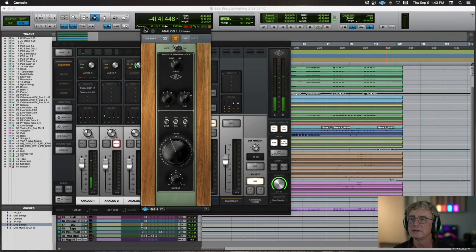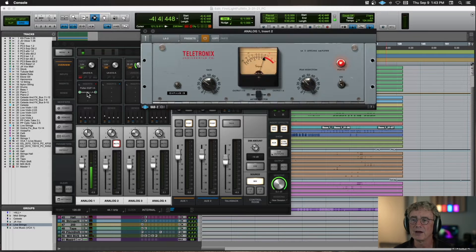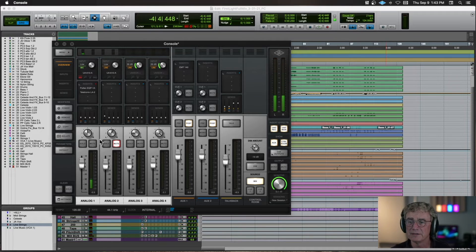The way this all works: I've got the TZ Audio microphone on a boom arm stand attached to my desk that I can move around. I've got that running into the UA Apollo, then it's going into the Pultec just to beef up some low end and a little high end, and then through the LA-2A — there's very little compression happening, it's just coloring the sound a little bit. The muting is really helpful when I'm in my film scoring class and I want to play a film or a piece of music on my computer screen — I don't want my live mic picking up room sound, so I can mute it and take that out of the equation.